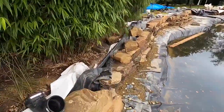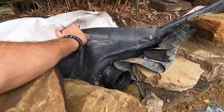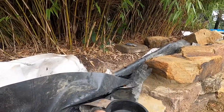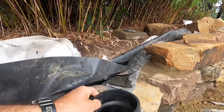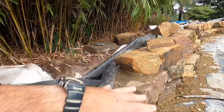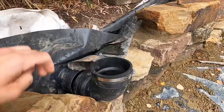So the two-inch overflow has had to be uprated to a four-inch overflow, and that's in place now via a tank connector. We've got an elbow which can be articulated to help calibrate the height of the pond, and we can extend this with a piece of pipe if needed, a leaf guard put over the top, and then this area can be concealed with some stonework.